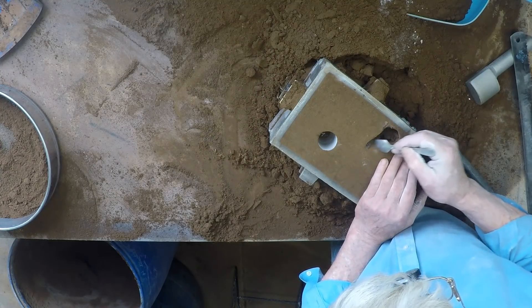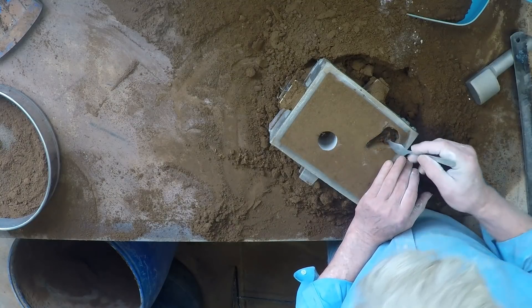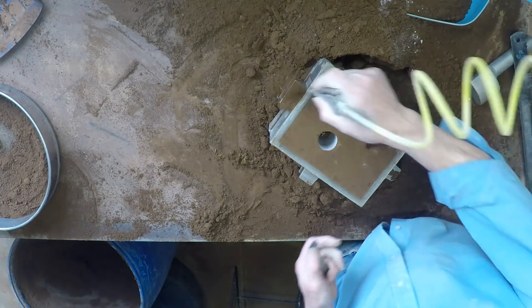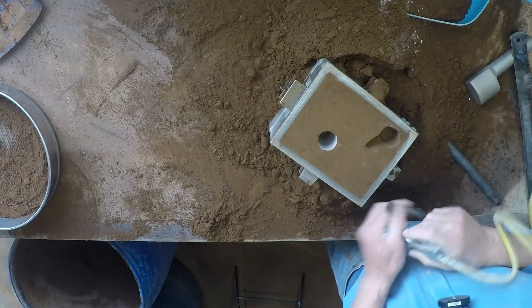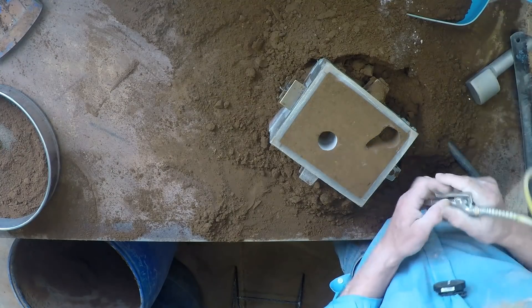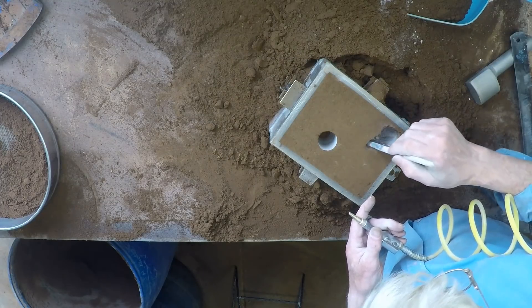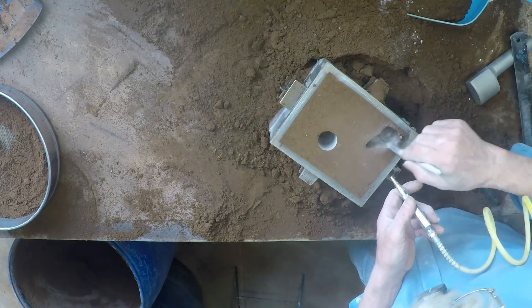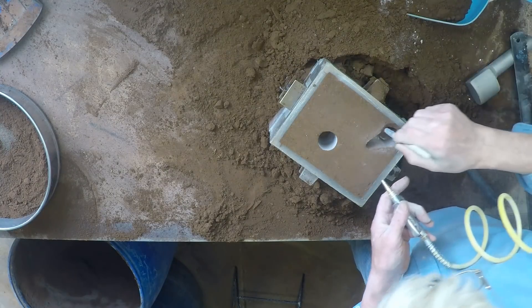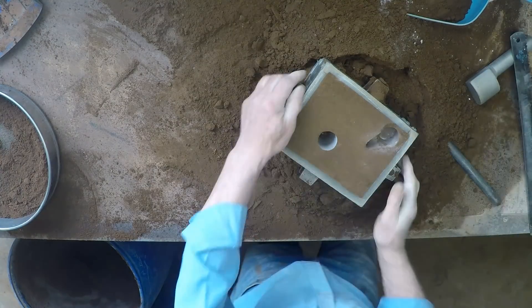Now I'll connect the pouring basin with the sprue. The idea here is that the pouring basin gives you something decent to aim at for a start. But you leave a little ridge between it and the actual sprue, and that ridge helps control the flow. The ridge does need to be quite well radiused if you can manage it. The best way to radius it is probably just with a brush. It's mainly the junction of the ridge with the sprue that needs to be radiused well. The other side can do with a bit of a radius but it's not quite so critically important.